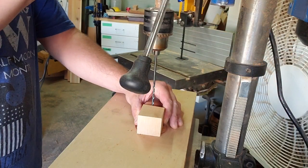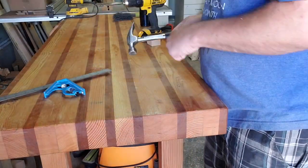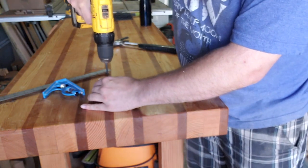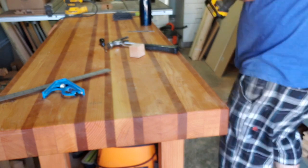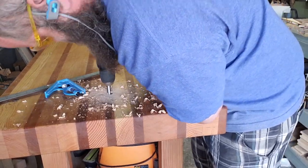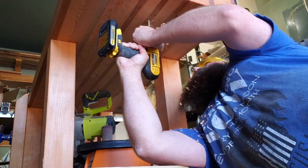I started by making what we'll call a guide block, with my drill press, which is just to keep my drill going straight up and down at 90 degrees in all directions while I'm drilling the holes. And I'm using my only drill bit that's long enough to get all the way through my bench, before — I guess we'll say it's a pilot hole. The idea was that it would be a guide for the Forstner bit to go straight down through, because it's kind of hard to keep a 90-degree straight up-and-down drilling operation with a handheld drill. That was my theory anyway. I don't know if it helped — I want to say that it did, because I did it. And if it didn't help, then it was a waste of time and effort. So it did.